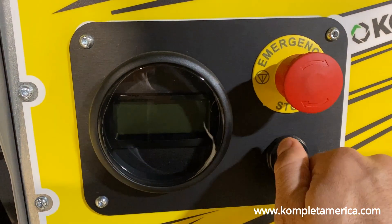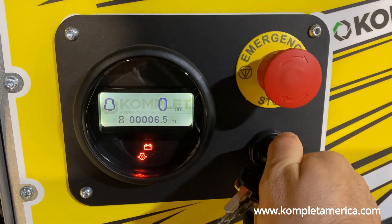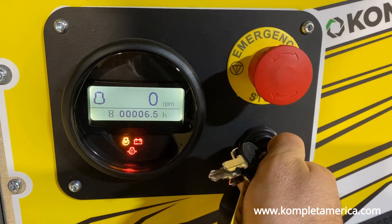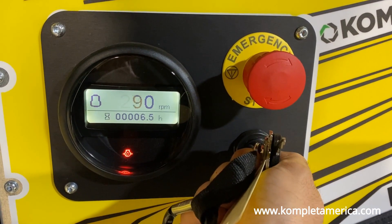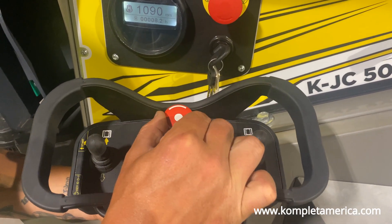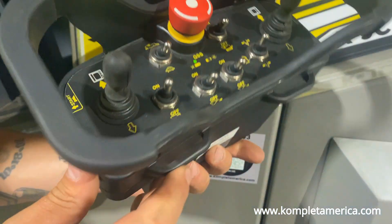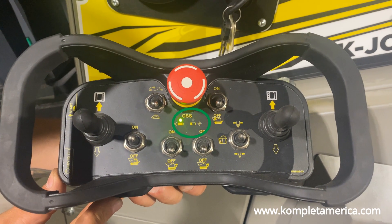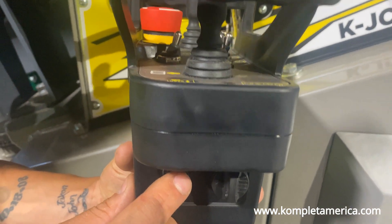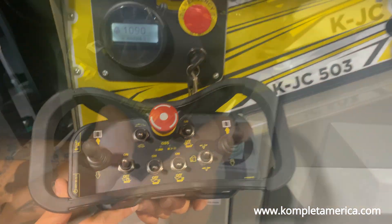If this is your first time starting the machine for the day and the engine is cold, then turn the key slightly to activate the preheater before you fully turn it to start the engine, and be sure to let it run in idle for a few minutes to warm up. To sync the remote controller, twist and pull the emergency stop button and make sure all the switches are in the down or neutral position. Next, turn the power switch on the left side so the green light on top starts to flash fast. At this time, press the green button on the left side once for a brief second until you see the green light on top start to flash slower.